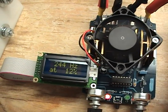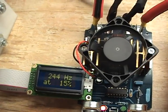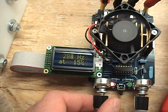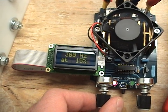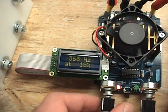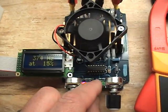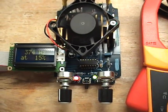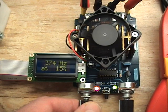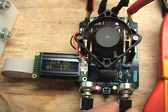You can see the duty cycle is at about 15%, and I can change the frequency right here with this knob — and you can hear it. Once you find your frequency or resonant frequency that you need, push this button here. The green LED will come on and that frequency is now locked into place. And you can go ahead and change your duty cycle.